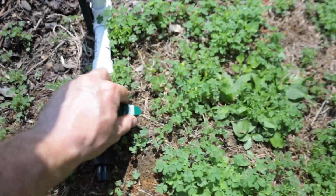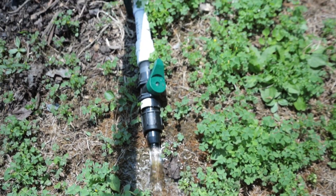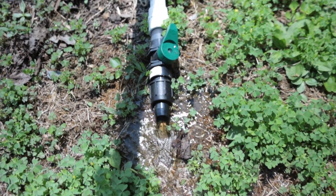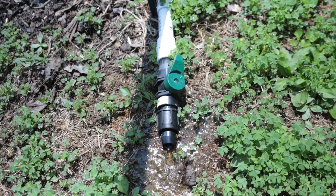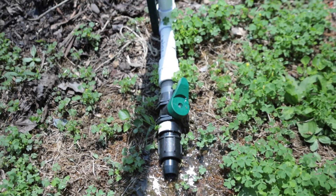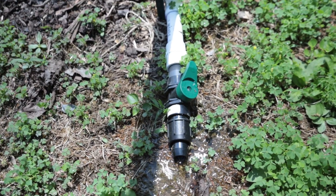At the end of the line here I have a flush valve, so I can flush out the end of the line. I have one on the other sprinkler over there too. These are great because when the weather gets colder or there's a threat of frost, I can simply flush out these lines and the connection line where it starts, making sure there's no freezing in the pipes. That also let me only bury the pipes about a foot deep.